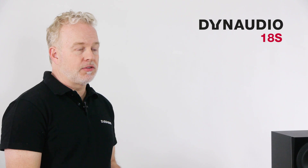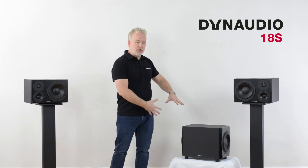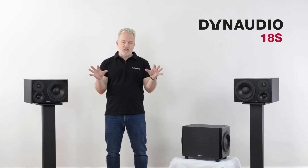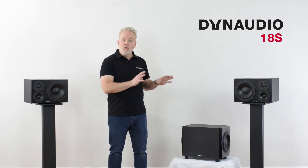In professional sound studios, subwoofers are used in two main ways. The first way is as an extension for main speakers to increase their low frequency response, or extend the response of the speakers into lower frequencies. The second is as a low frequency effects channel in a surround mixing environment, where the LFE channel is a dedicated channel only delivering certain specific low frequency sound effects or musical elements that only come out of the subwoofer. This is often referred to as the boom channel or the 0.1 channel in a 5.1 surround system.